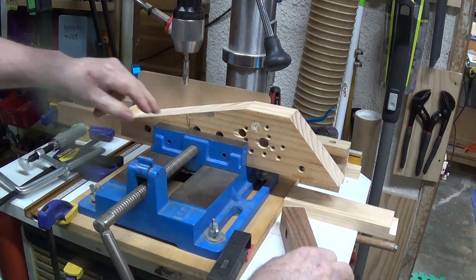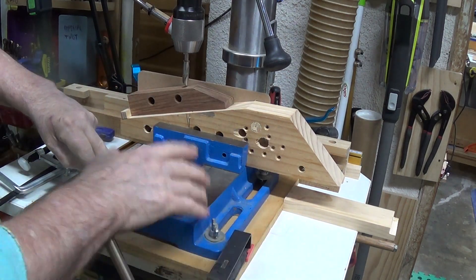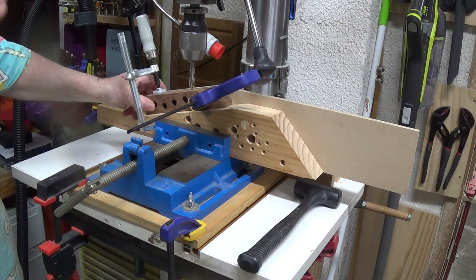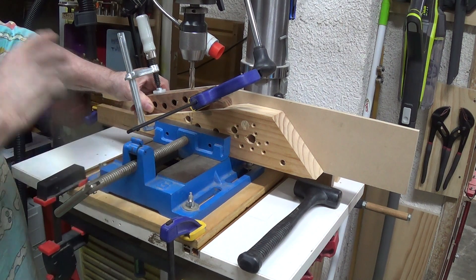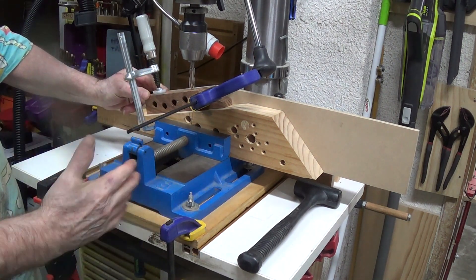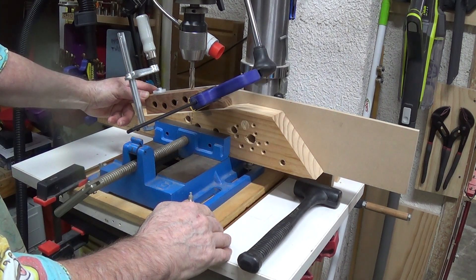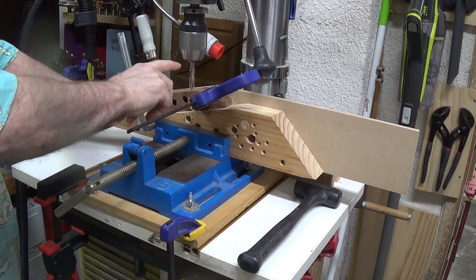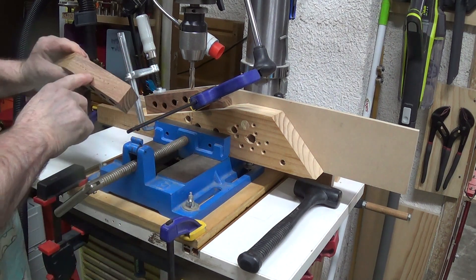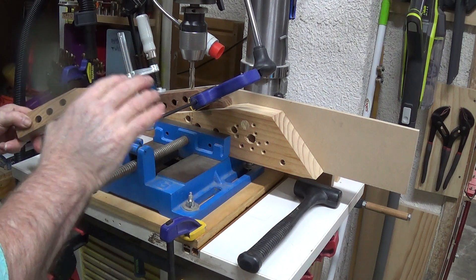What I've done is put that backing board there to snug this up against it. I've actually clamped this vise to the bench. There was a bit of stuffing around trying to get this set up right, because naturally drilling on a 15-degree angle is a bit critical. I've set the fence — this is the clamp system which holds a 15-degree block I used on the previous 12-inch. It's now set on the centre line, set on the first spot.